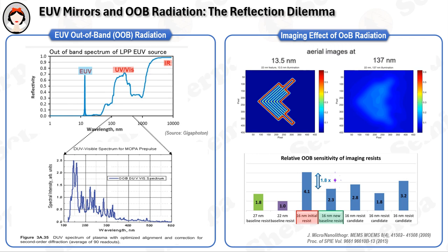To address these challenges, tools like spectral purity filters — including thin membranes, multilayer mirrors, and specialized gratings — are employed to prevent OOB radiation from reaching the illumination optics. By repeatedly reflecting light through the multilayer mirrors, the light spectrum from the EUV source is further refined. Manufacturers implement a variety of filters and design optimizations to minimize OOB radiation. Users can also apply special coatings on top of the photoresist, or use resists specifically engineered to be insensitive to OOB radiation, preventing unwanted effects without additional coating layers.